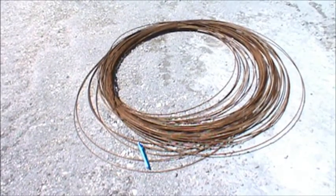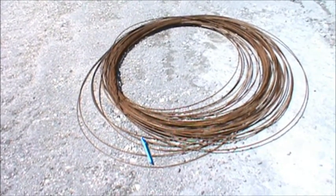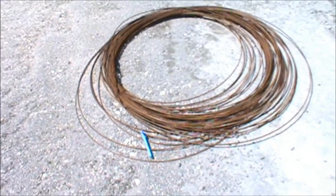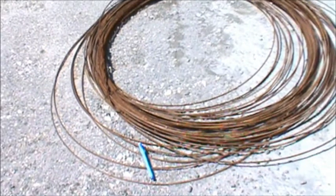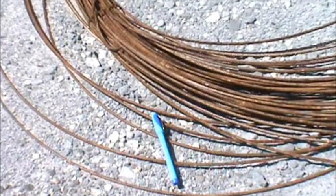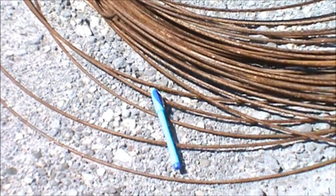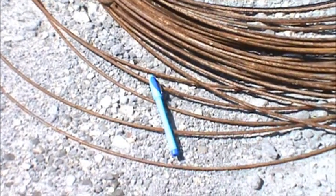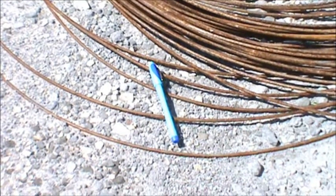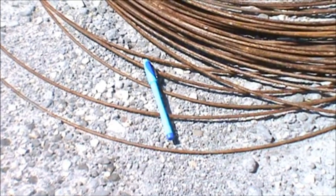ConsulCore has many projects. The one we're looking at right now is a three-million-gallon wire-wound tank at a wastewater treatment plant. We've treated the interior of this tank and now we're focusing on the exterior. As you can see, the material in the photograph is the wire that is pre-stressed and wrapped around the exterior of this tank and then coated with shotcrete. This is one of the materials we propose to protect with the application of this waterproofing material to the exterior surface of the tank.